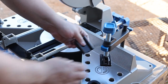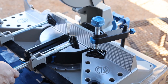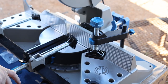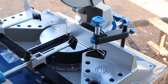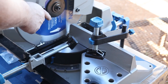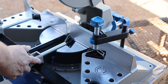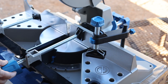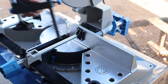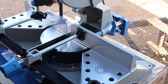They also work on the upper clamp to clamp things down. One thing I like about having clamping on both the feed side and the cut side is that a lot of times with my other chop saw, when you go to cut a little piece off, those things have a tendency to go flying, which can be pretty dangerous. So it's nice to have the option of clamping the cut end so it doesn't go anywhere. This clamp can also be moved to the other side if you need it there — there's a couple different spots.